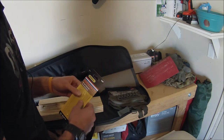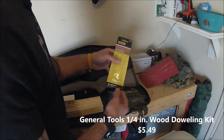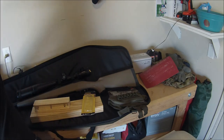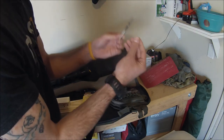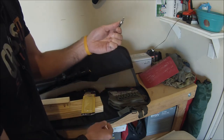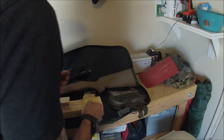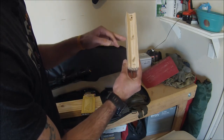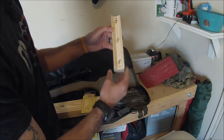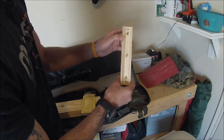After I worked the actual stock itself, I went to Lowe's or Home Depot and got a dowel kit, which comes with the actual dowels you'll use for your cheek rest and a drill guide so you can set the distance to be drilled and easily make pilot holes for those dowels — about five or six bucks. After I measured where those dowels would be placed, I drilled the pilot holes, added a little bit of wood glue, and tapped them in.